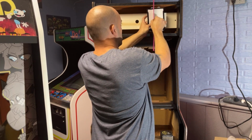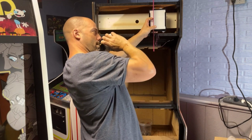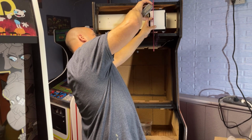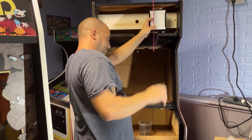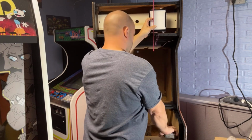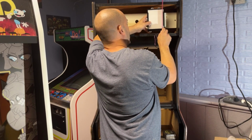This is going to be fun. 3¼ inches. So I'm 3¼ inches. A 2x4 is 1.5 inches. 2 2x4s is 3 inches. I'm still 1/4 inch short at that rate.